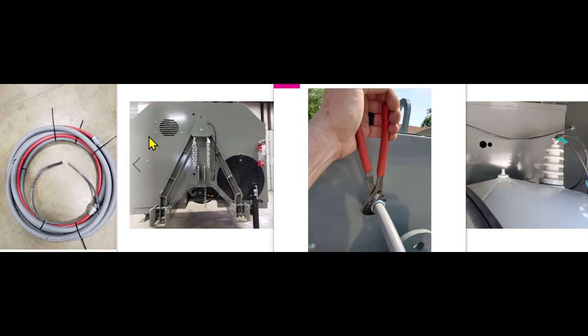And I'm going to point out next here the connection points that are available. First, on your cart, you have a connection point up high here, close to the top of the cart. That is a 1-inch diameter hole, which will accept these male adapters on the end of your conduit. So you can fasten the conduit up high, you can bring it in down low, or the third option would be that you can actually bring it in underneath of this arch at the bottom of the 3-point connection area down here.